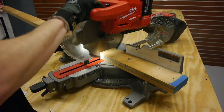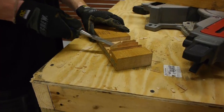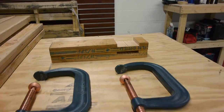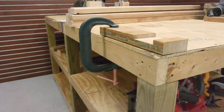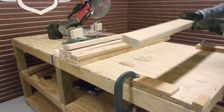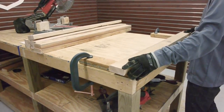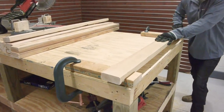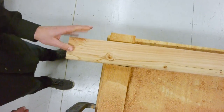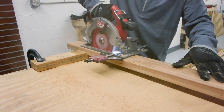Can you tell me how this jig works? Yeah, so what we did is take a 2x4 and cut a notch about a half inch deep into the wood, just slightly wider than the 2x4 that you're gonna cut. On the opposite end, we clamp it down to the table which gives us a pivot point which these boards can rotate, and we place them about 4 feet apart. When you place your 2x4 in the notches and apply any pressure forward or backwards, it actually clamps the board in place and keeps it from moving forward or up out of your jig. And did it work? It worked great — we set it up in a matter of 20 minutes and cut several 2x4s, no problem.